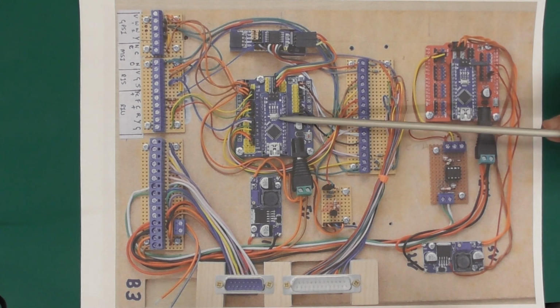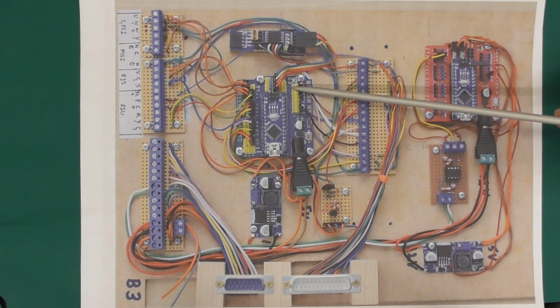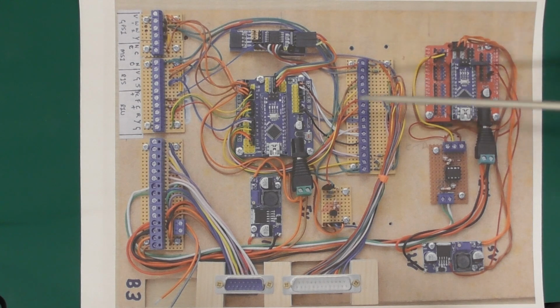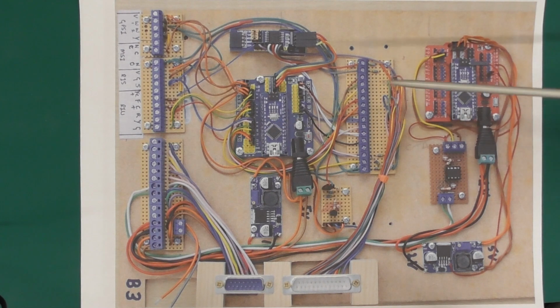And this runs two signals that face one another. Signal 1 will always be in the up direction, and signal 2 will always be in the down direction, as specified for that track. They face one another, and the sensor for the signals is in between them, so that whichever way you're running, after you pass the signal, you pass the sensor that says you've passed the signal. If your current running direction is up, then the down signal is permanently red. And if you're running down, then the up signal is permanently red. And that's the way I've signalled it.